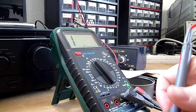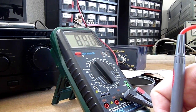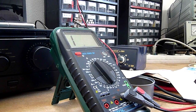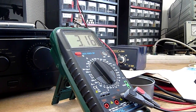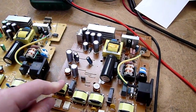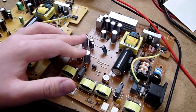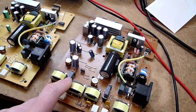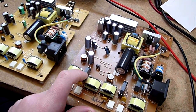So I think the left one was, yeah, this one is pretty much just nothing there, but if we look at the right power supply, 3k, yeah, it's a 3k resistor. That's obviously not going to pass enough current to power on the inverter, and I've spent so much time with a mate, and we couldn't understand, because we measured these caps here and there was power everywhere. I mean, you've got voltage at the collectors of the drive transistors, why on earth would it not power on?